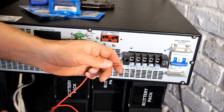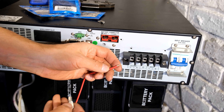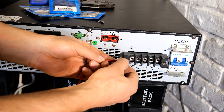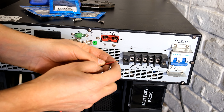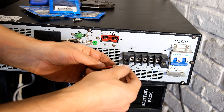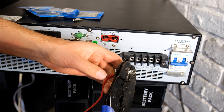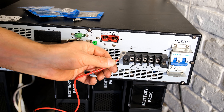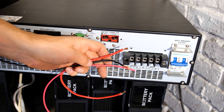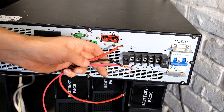The amount of copper you expose depends on the type of lug. For example there's a perfect fit, but depending on the size of the lug — a bigger lug is for a bigger cable and is longer — you will need to expose the correct amount for the size of lug you're using. I would seat it in the crimper and crimp it. The size of the cable is very important. The circuit breaker here says 63 amps, which means you would need to use a cable that can handle 63 amps.